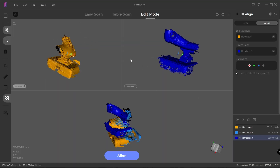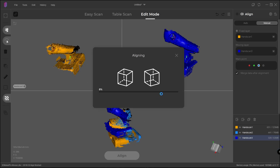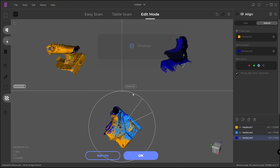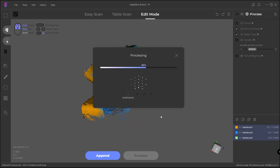If you have multiple scans, now is the time to align those scans together. Alignment works very well — the automation mode is great, but I usually like to do it manually. It's very quick to just pick out a few targets, and you can even add a fourth or fifth point if you need more than three references. Next up is the fusion process, where you take all the raw data frames and make one mesh out of it. This is quite a fast process.